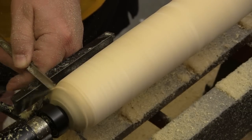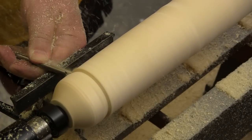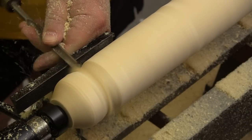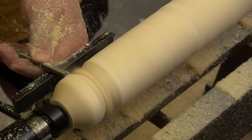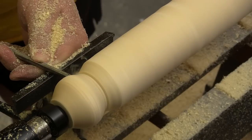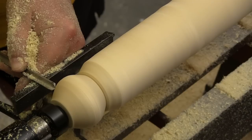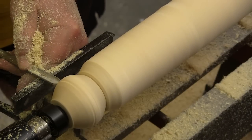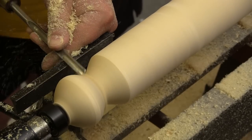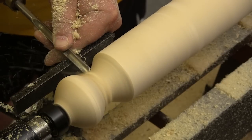Now with the piece generally rounded, we'll go to the 3/8 spindle gouge again. This piece is still turning at about 2200 RPM, so I wanted to see if the spindle gouge will pick up any vibrations. Even when I lean on it a little bit and take a deeper cut than I should, it cuts right through and everything stays nice and smooth. The wood isn't vibrating so the tool stays nice and smooth on the surface. If you're just learning to turn, that kind of smoothness can be important to learning how to handle the tools — you'll find that you can start your own catches just fine, without the workpiece vibrating or the tools chattering, both of which can start a catch real quick.